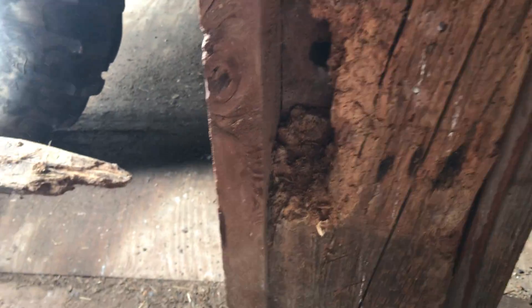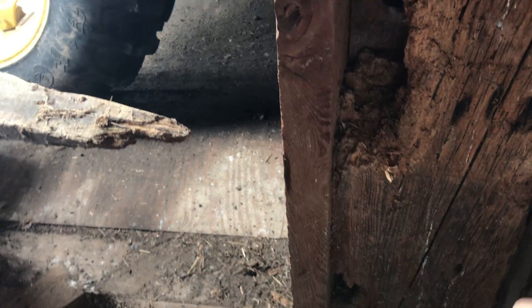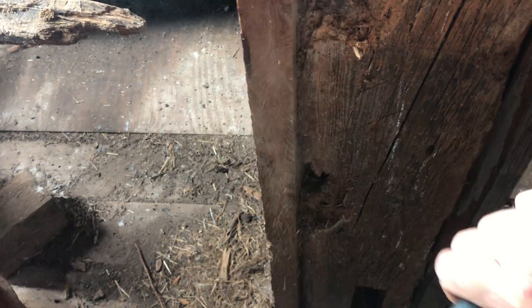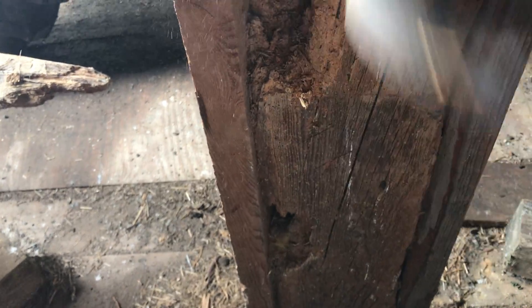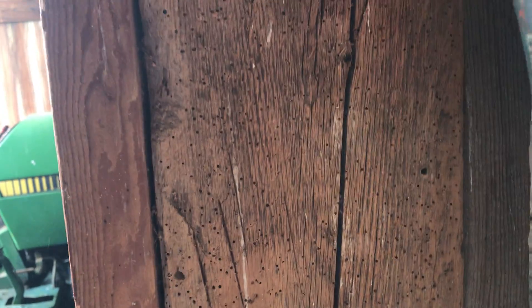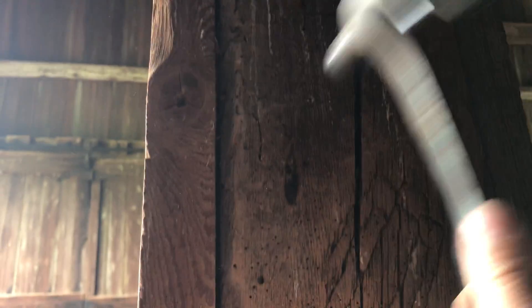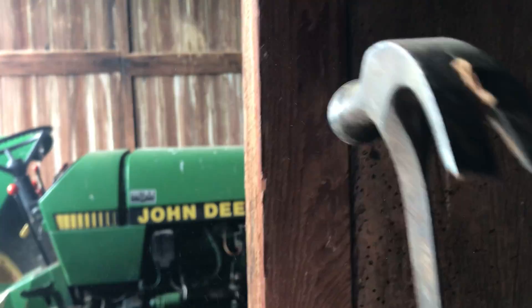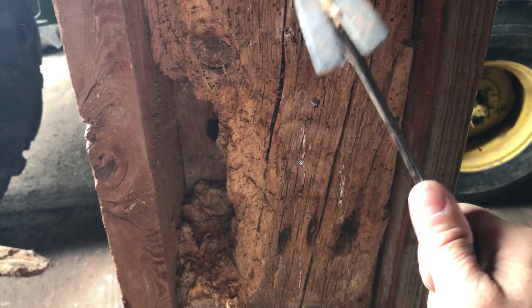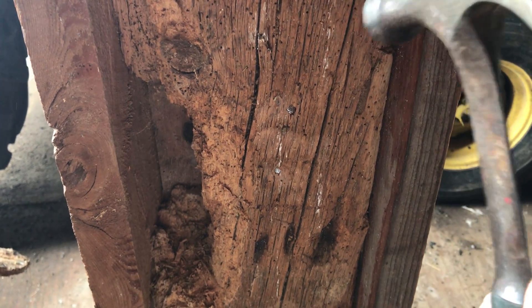It's kind of a surface thing. If I hit here, see the difference in sound — a little bit softer here, little softer over here. Not surprising — you can see the dust coming off. Solid here, not so solid here. Remember this is only two inches thick. Up into here: solid. Not so solid when I hit next to the crack. If I come over here: good, solid. So even this was laminated on here, sistered down there, however you want to call it — but surprisingly these things are better than you might think.